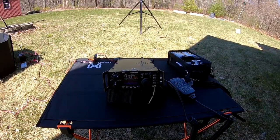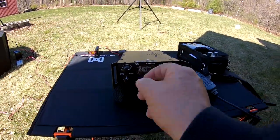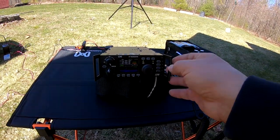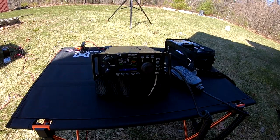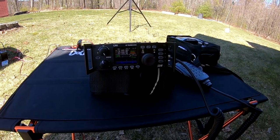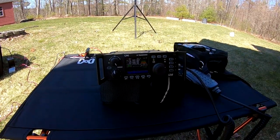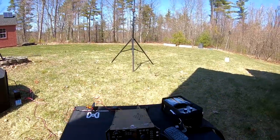At the beginning of this video I said I wanted to focus more on getting consistent and reliable worldwide communications. The other radio I was using last year — the MCHF — was a QRP radio, less than 10 watts. This radio is one of the new SDR, or software-defined radios, that you can program in a variety of ways depending on the use case. This radio goes to 20 watts, and there's a big difference between 10 watts and 20 watts for reliable communication. I get very consistent worldwide contacts using this 20-watt HF radio with a simple vertical antenna.